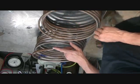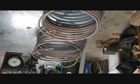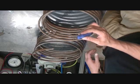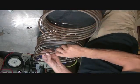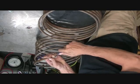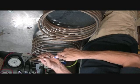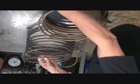Then we have a little bit of internal burr in there, so we're going to want to deburr that. What I'm going to use is just a little deburring tool, right? It's going to go on the inside. It's just going to remove that burr off. A nice little bit of an edge. Make sure everything comes out.